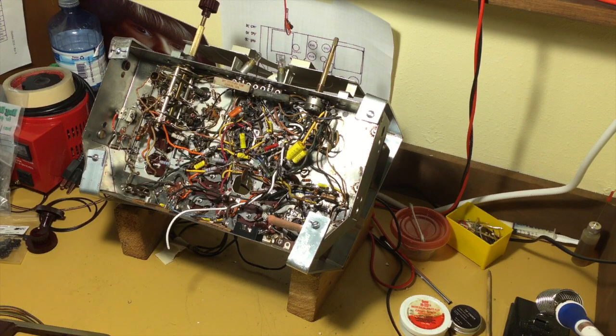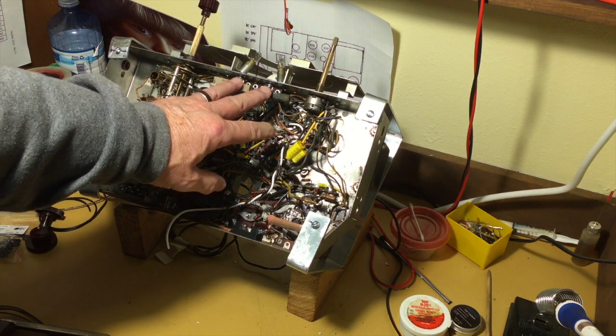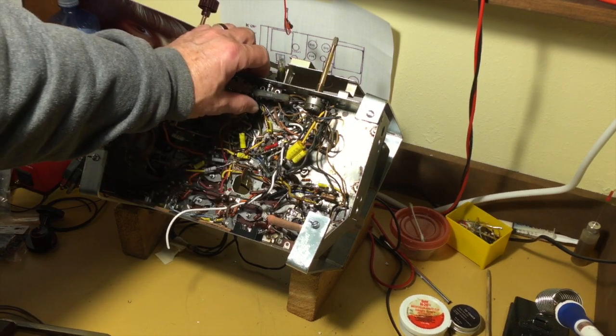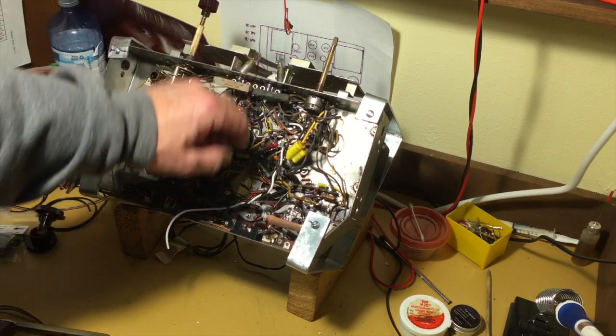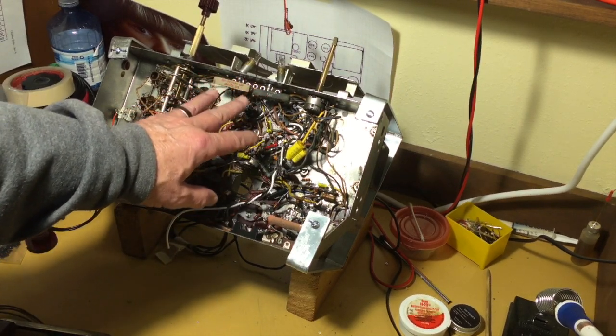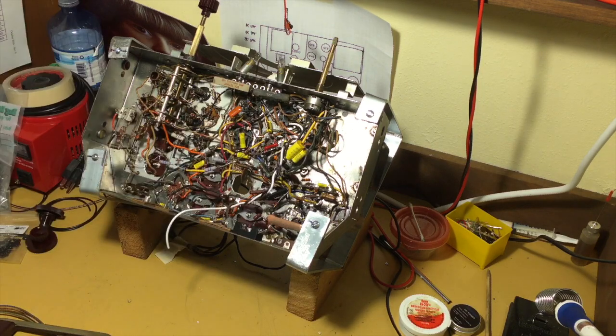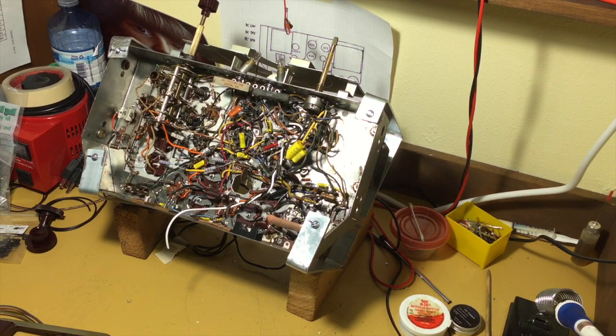This is the chassis, the 10H20Z chassis. It's recapped completely now. I've mounted the two wire-wound resistors onto the rail here. Unless they show some problem from overheating, that's where they'll stay. I'm still waiting for the correct audio output transformer. It's on its way.